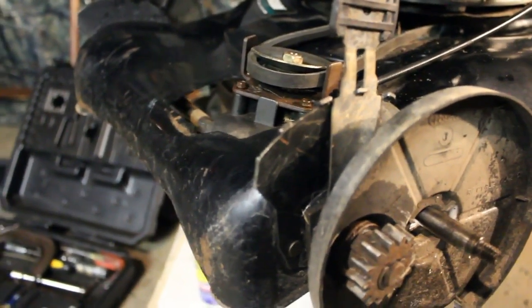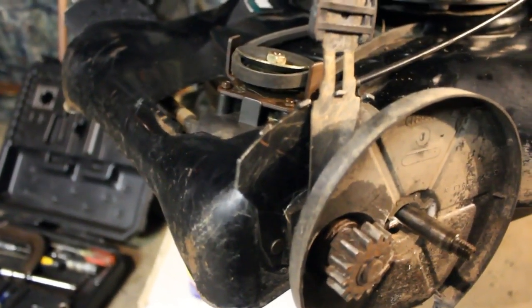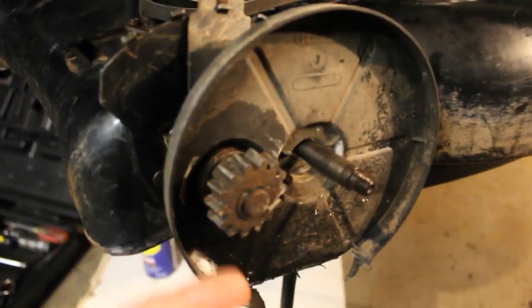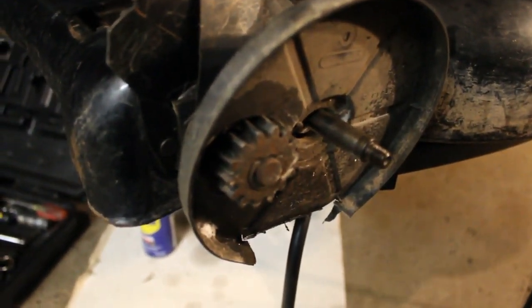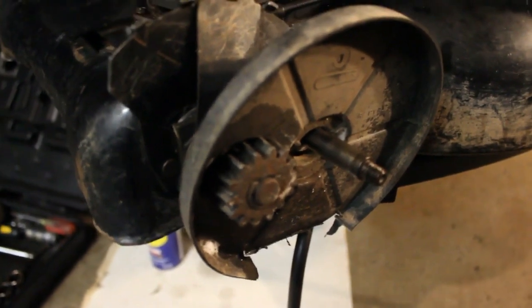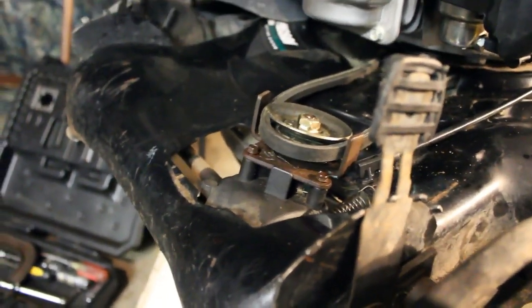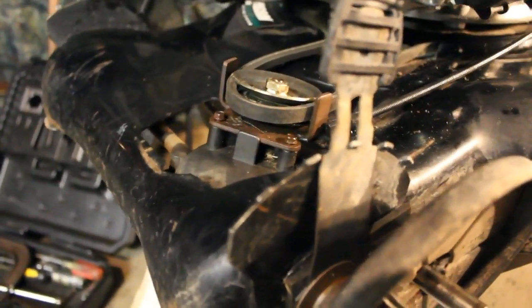Maybe it can be fixed. Usually there's a worm gear inside. There are some bearings here and there is some play, so I suspect that's why it damaged the wheels - these shouldn't have any play. If the cost of the bearings and maybe something inside the transmission can be replaced fairly cheaply, we'll go ahead and do that. Just because something isn't working doesn't mean the whole thing is shot - there might be a gear we can replace.